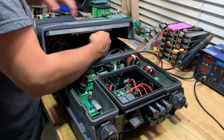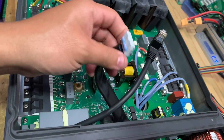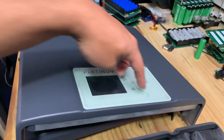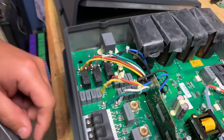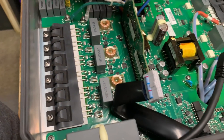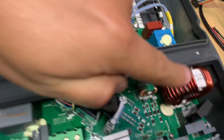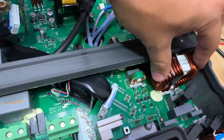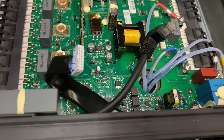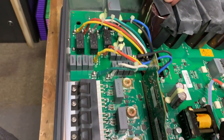Now let's take this cover off. Look at that — this one has like a little card there. Two connectors: one for the little screen, and this one for all the communication and network stuff — it's all in this card. Here are the power electronics, the MOSFETs, and then those go over to the transformers. Some people said these were not transformers but inductors. As I understand it, an inductor is a transformer that only has a single winding. Because this one has several windings in the same core, that would make it a transformer. These are all potted, and there are nice capacitors here.